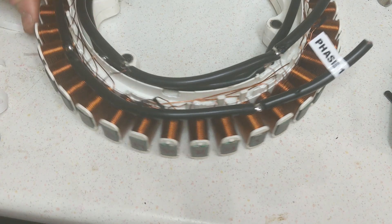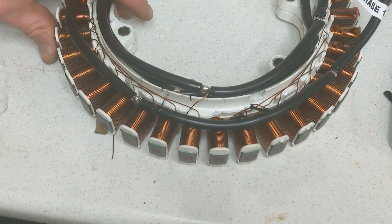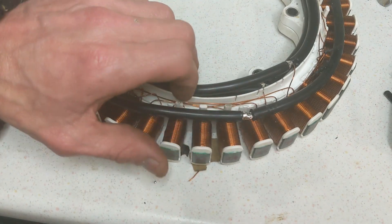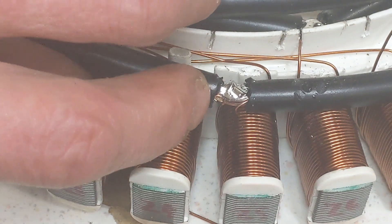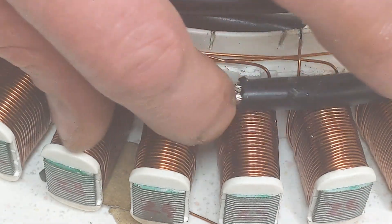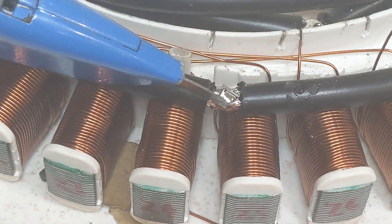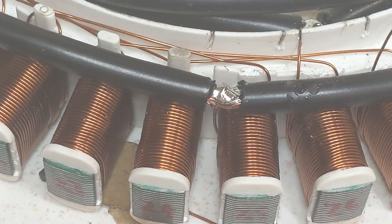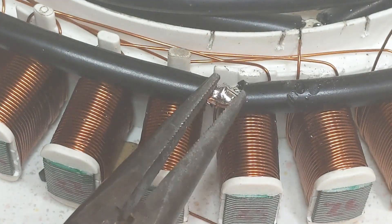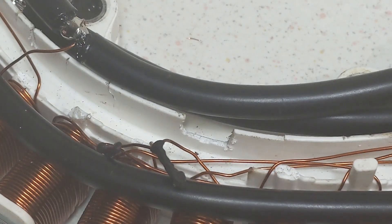It had to be repaired as well — well it didn't have to be repaired, but the wires have been chopped and joined together, and it all needed soldering. The soldering is quite tricky especially with a poor quality soldering iron — it won't have gone all the way through and completely soaked the underside, I know that for a fact. What I was doing was opening up the wire with the stanley blade, pulling the wire through the center, wrapping it around, and then if you squeeze it with a pair of pliers before you solder it, it just seems to work a lot better. So that's what I ended up doing.